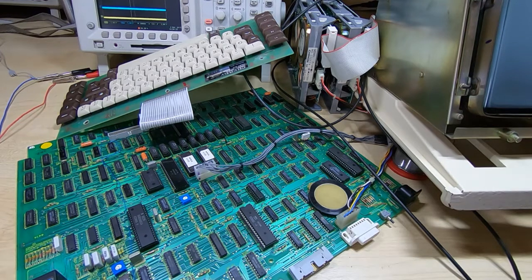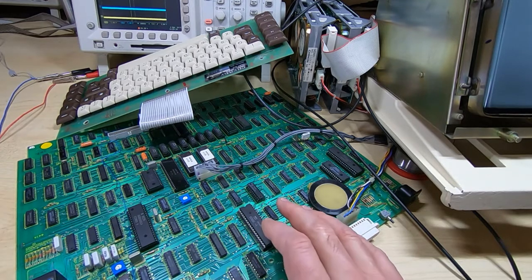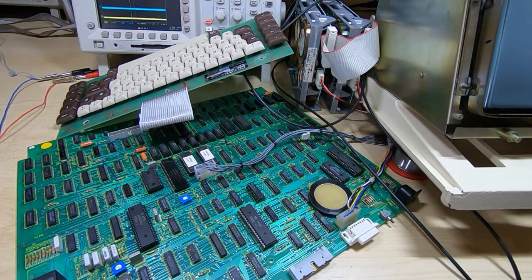I do have other information on the documents I have, and for example video is shown at 4000 hex to CFFF, and that wasn't detected by the Fluke either. And there is some additional character RAM as well, and that's at 7600 hex to 85FF hex, and that wasn't detected either. I find it unlikely that those areas are banked out, or at least not available in every bank, because it would make the system very inefficient, but it is perfectly possible that they just weren't in the bank that the Fluke has access to. But it does seem odd that none of that is available to the Z80 in all banks. So really the next step is to start looking into the in-out decoding.